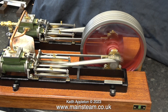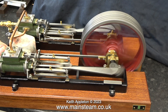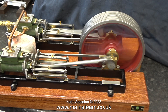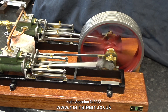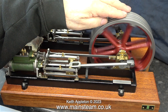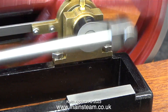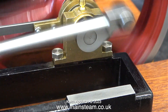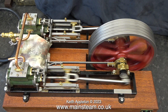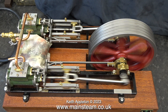Initially you may think it doesn't sound too bad, but please continue watching the video — there is a distinct loud knock in one part of the cycle. The reason for this is because the crank web nearest to the camera is loose on the crankshaft.